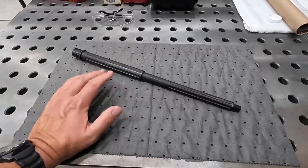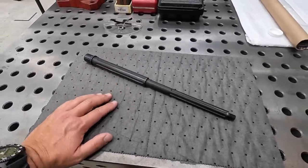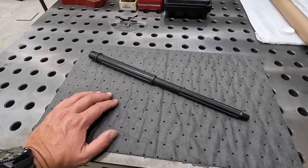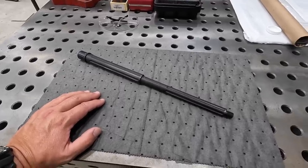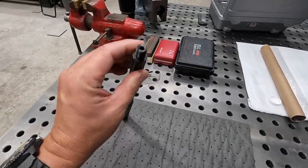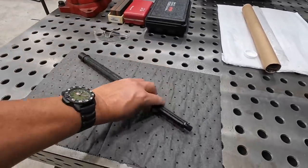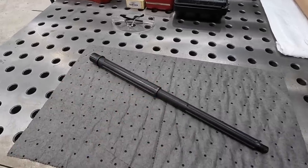It's really helpful for many industries out there, especially in the automotive industry. If you ever look at parts that go into an automobile, maybe different axles and things like that, if you look at the end of the shaft and you see those lines that are pressed into the face, that's because it was turned on a face driver system, like from Riten Industries.